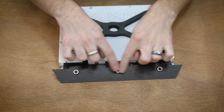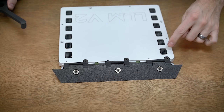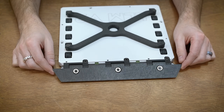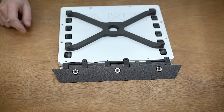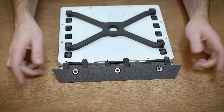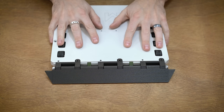On the underside of the wedge we've got three magnets, which work in conjunction with three other magnets on each side. Overall, this gives about three pounds worth of downforce with the magnets on the wedge. These can be very easily removed — I can use two, one, or none of them. They're adjustable and they help keep the wedge down to the ground, because if the wedge isn't on the ground, then what's the point?